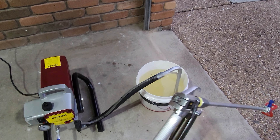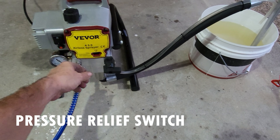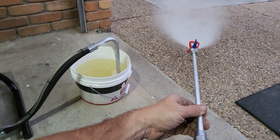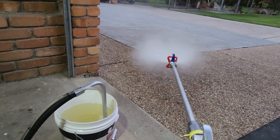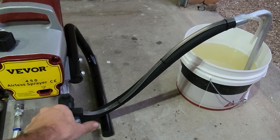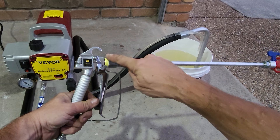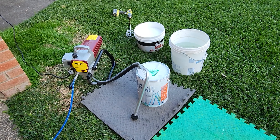I'm going to test this using water before putting it into paint. I've already pre-primed it — there's water in the line. That's the wide spray of the nozzle. I turned it off and that's just me releasing the pressure at the end of a spray. You can see the threaded tape — that yellow tape — I found I had to do that or else water and paint will leak out.